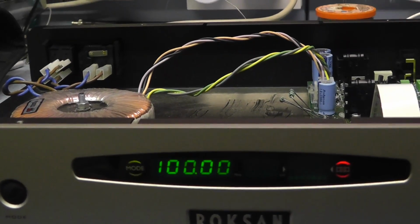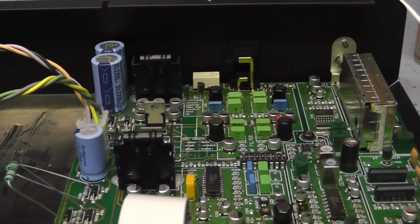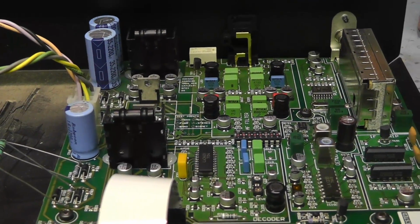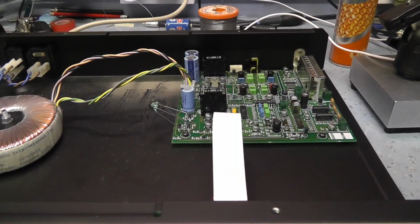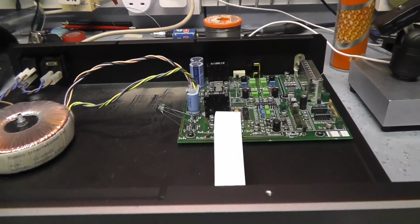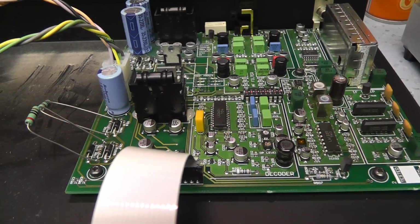So the next thing to do is to connect it up to an aerial. We need to monitor this to make sure these resistors don't start smoking. If they do, there's something drawing excessive current. Now, you're probably saying, well, these fusible resistors, Simon, they've blown. There's a reason for that. Yeah, there may be a reason for that. There may be an intermittent faulty capacitor that's failing and blowing them up.